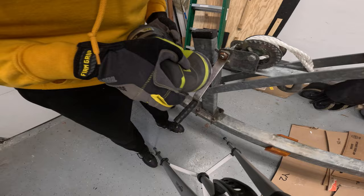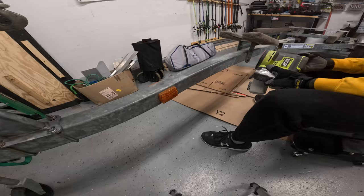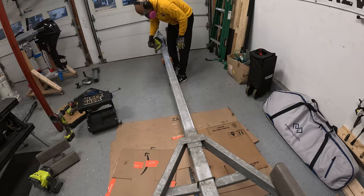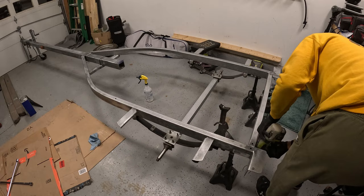Now that that's out of the way, it's time to sand everything down. I'm doing this to remove all the rust spots and any calcification on the trailer — this will prep the surface for paint. For the first round of sanding, I primarily use a combination of a light wire brush and the orbital sander with 80-grit sandpaper, alternating between the two depending on the condition of the trailer. I used 80-grit to reduce time spent sanding, but I needed to be really careful how much pressure I put on the orbital sander to not go too deep and leave sanding tracks on the aluminum.